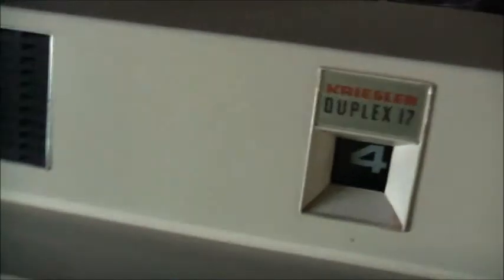So you listen for rattling. I can hear just a hum from the transformer and a little bit of noise from the yoke, but it's not actually a rattling winding, it's just you can hear the power going through it. Most old TVs had some really noisy yokes back then, or the friction coils. Have a good look. Oh, that smell. That aroma, I love it. What a glow in there.